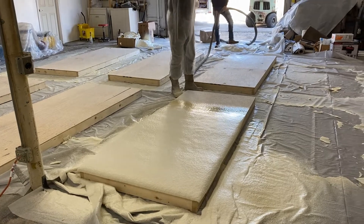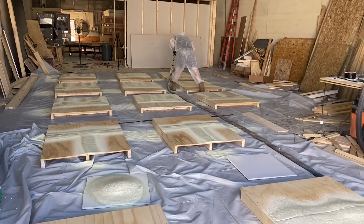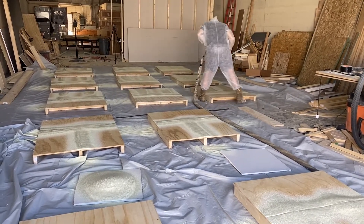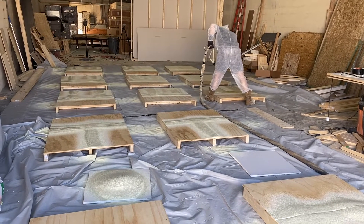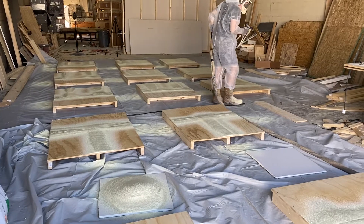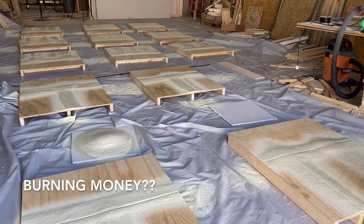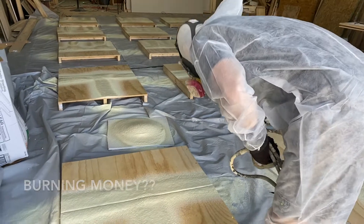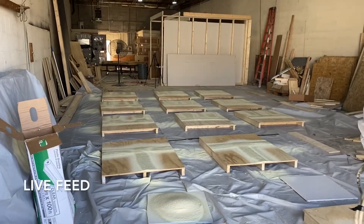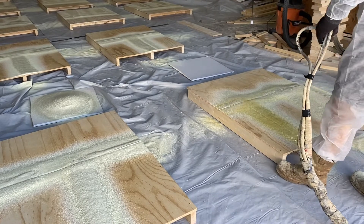Round two - we're doing some roof decks, spraying some Accu-Foam Creative Polymers roofing foam. We had to get AC plywood without knots in it because the knots accelerate the burning. These panels are all going to get burnt probably in the next few weeks. Once this is done we're going to put some coating on them and they'll get shipped out of state to a burn facility. Everything is being documented by camera and recorded for Intertech so they can witness the spray and the whole testing procedure.